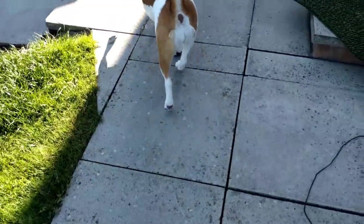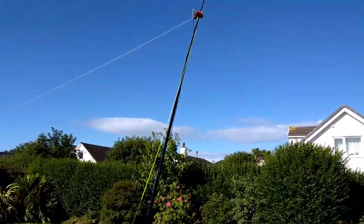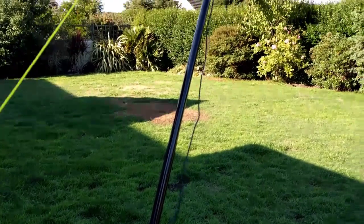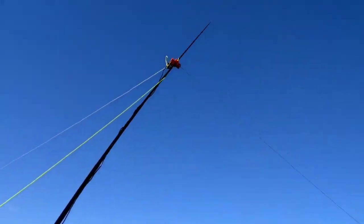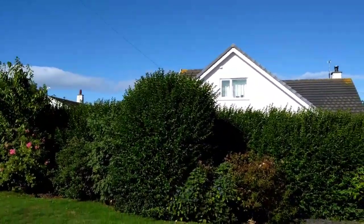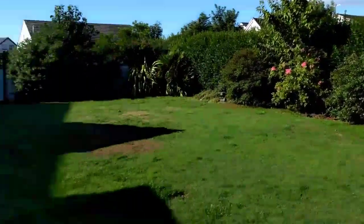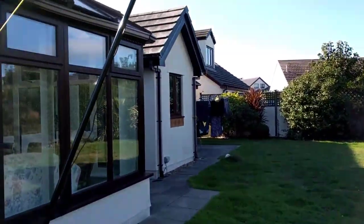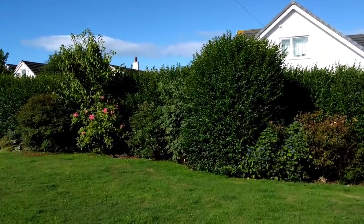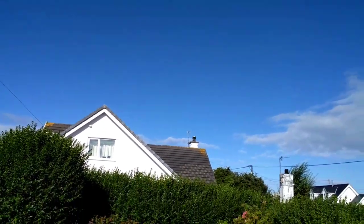It's a four-metre windsock-type pole with a very low-strung wire dipole strapped up to the building over there and to a tree or bush over there. It shouldn't work but it does — for a holiday in Wales.